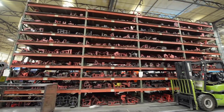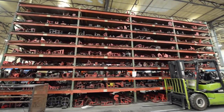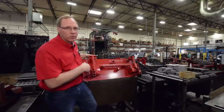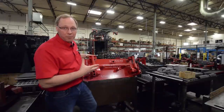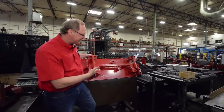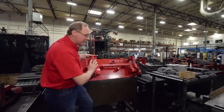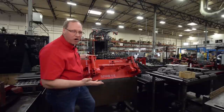This is an example of a jig — essentially a pattern that allows us to replicate a steel assembly over and over again, like a jigsaw puzzle. It holds all the individual pieces and parts of steel in place so we can tack weld them. Every time a car changes, we have to make a new jig. Roadmaster has over 1,200 unique jigs just for brackets — just to adapt tow bars to cars. Those 1,200 jigs allow us to fit approximately 2,000 different years, makes, and models of vehicles.